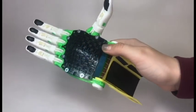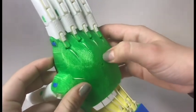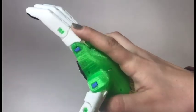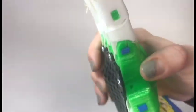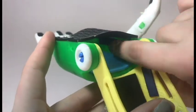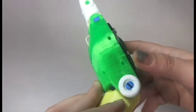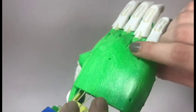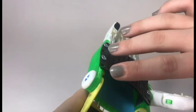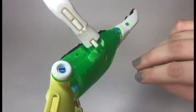This is the handpiece. I've actually already put this hand together so you can't see much of it, but we can check out the top. As you can see, the layers were very smooth — you can barely see the layer lines besides the actual model. It looks great, and the pins I printed are very, very strong, so that is kind of a strength test. There were overhangs and they all did great. The bottom half did great as well even though it was printed on a raft. There are smooth walls, and though there was some beading, that wasn't really a problem. The holes turned out great, the channels underneath were very clean with no stringing in the overhangs, and the roundness turned out great. It actually stuck very nicely to the raft and came off very easily, so this filament can definitely be printed with a raft very easily.